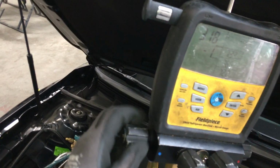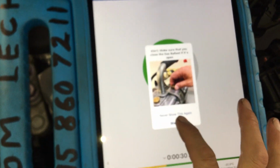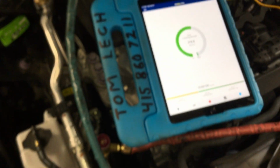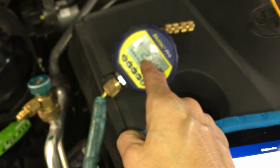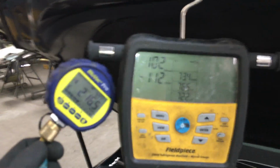Now, did you see that jump up here in the gauge and you see how fast that's going down? Okay, let me kill this again. It's going down. So we're down to 200. So we just lost what's inside this line. Dropped it from the 65 that was up here, and we're reading 200 at this point here. 233, we're at 100 something. That's a difference of almost 100 microns between here and here.